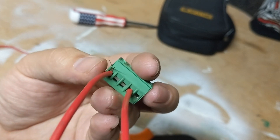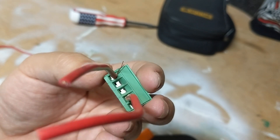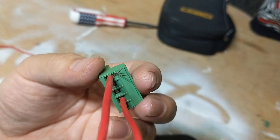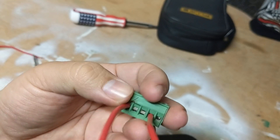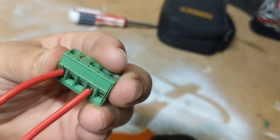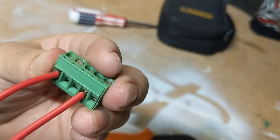The other problem is you have a couple strands coming out sometimes because somebody doesn't know what they're doing. You stab yourself when you're down on your knees trying to do some readings and somebody didn't put everything in there properly. Or they short out because they hit the terminal next to it. Obviously it's supposed to look like this one here — it's still good, but with a ferrule it just makes it cleaner and nicer.